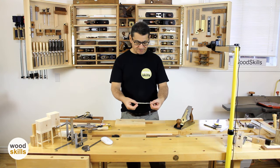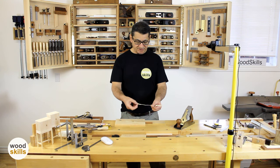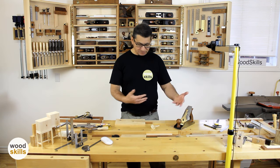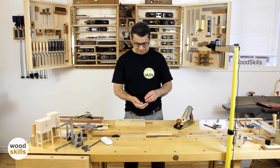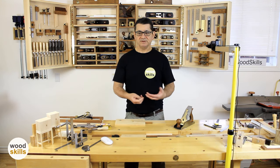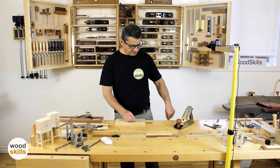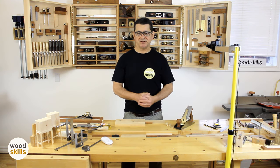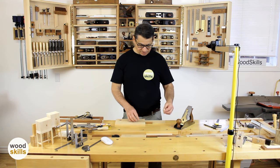Use this to count the number of shavings. By counting shavings you can easily achieve the correct width without having to resort to any measuring tools. It's a difficult concept to explain, but I think I've made it clear that it's the next level of hand planing — you're not just hand planing, but introducing more precision by counting shavings and ensuring they are the correct width.